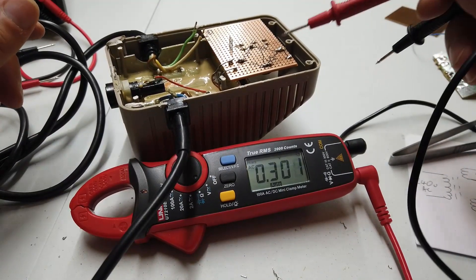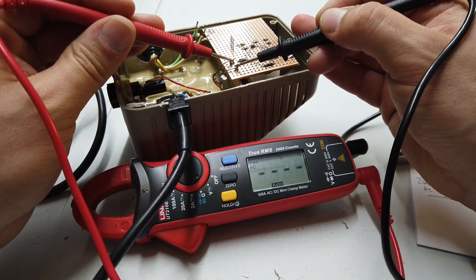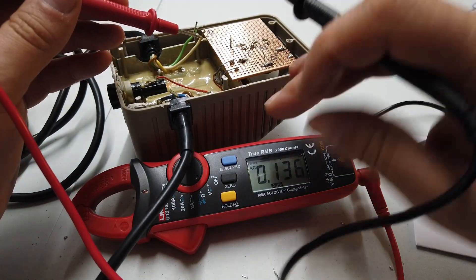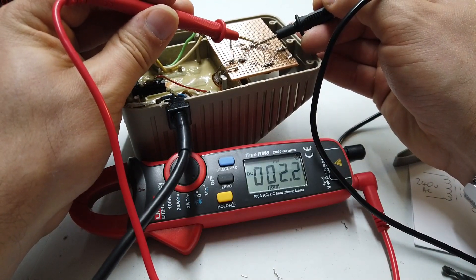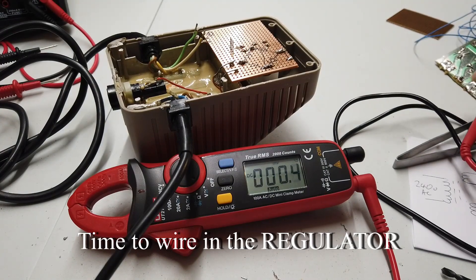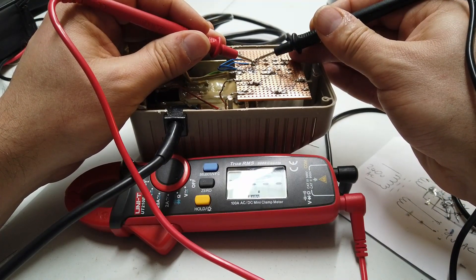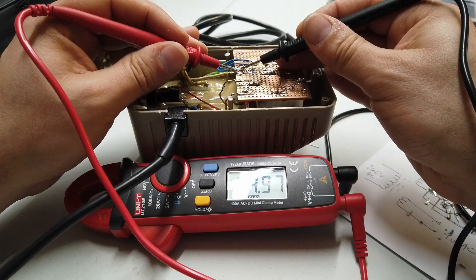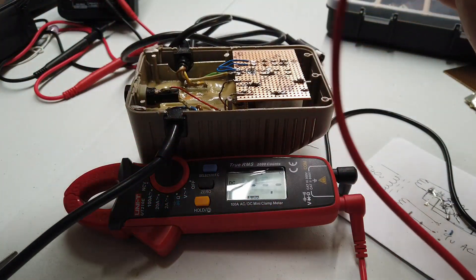I always like to test circuits in a modular way, so I've just bodged this in for right now. With the meter set to AC volts, let's look at the output of the transformer — 10.46 volts, happy days. That's going into the bridge rectifier. Switching to DC volts we should get a slightly higher voltage out of the bridge rectifier, and indeed we get 13.6 volts DC. Now hooking up the voltage regulator — on the output we have almost exactly 5 volts: 4.97 volts.